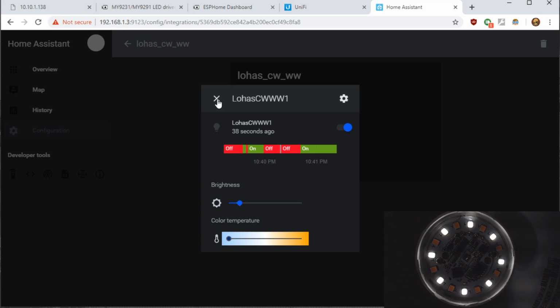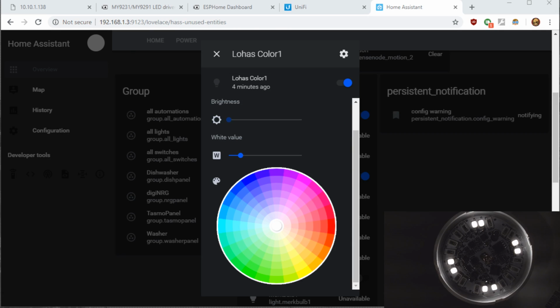Now let's check out the LOHAS color bulb. So for the LOHAS color bulb, we had the same issue as there was two channels of cool white. And there was only one set of LEDs appearing if we didn't also use the same copy command. So again, we won't go through the whole configuration of that. We will just leave a sample in the description of the video where you can download that file and change up the Wi-Fi SSID and password and names to your liking and utilize this same bulb with ESPHome.